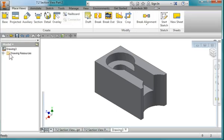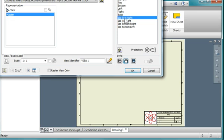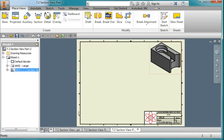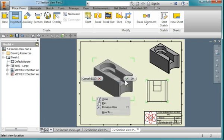I'm going to create a new drawing. I'll place an ISO top-right view — make sure it's shaded — and set the scale to three to one. Hit OK, hit OK again, and I'll reposition the ISO view up in the corner. I'll create a new base view, make it the right view, set it to four to one, and place it right there. Right mouse click, hit OK.